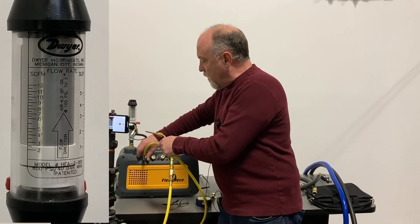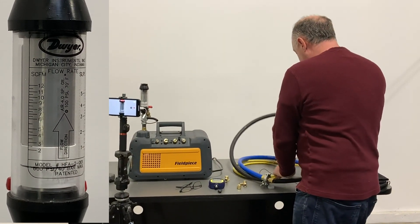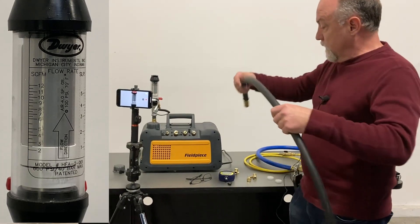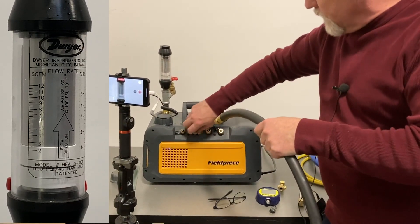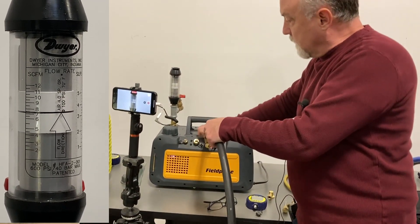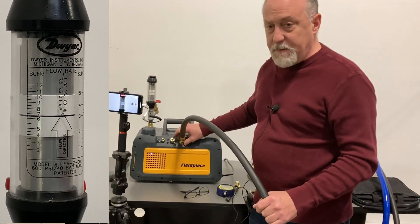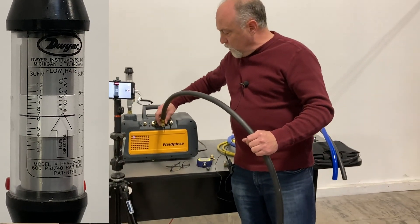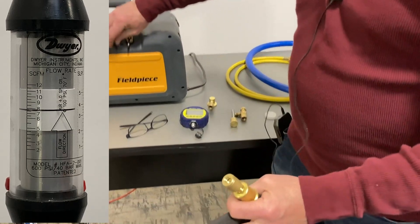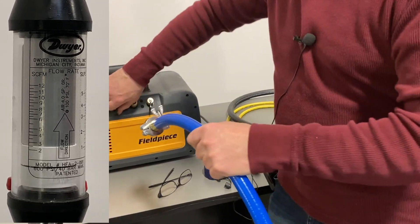Let's cap this back off and connect the competitor's hose. This is a 3/8 by 1/4 hose, and the ports don't make too much of a difference there as I showed at the beginning. You can see when we connect this hose it's pulling down to about seven CFM — not bad, just a tiny bit of loss. You've got six feet of hose here and it pulls down to about 7 CFM, so the quarter-inch porting on the end is not causing a lot of restriction and the flow at the Schrader port is fine.